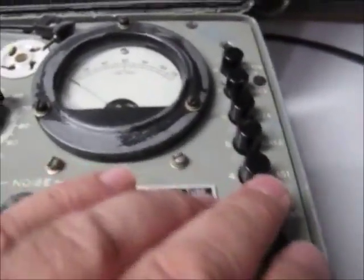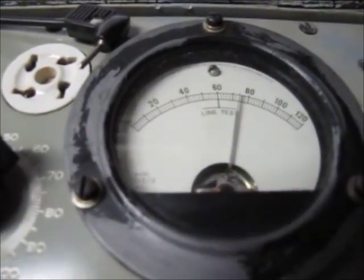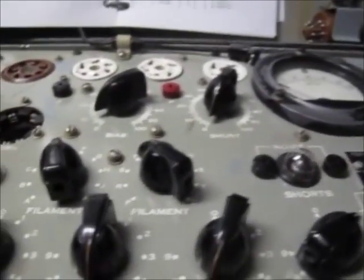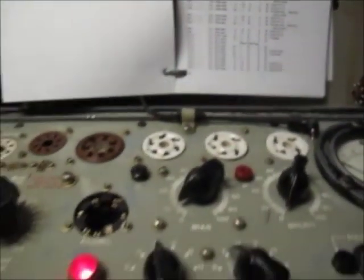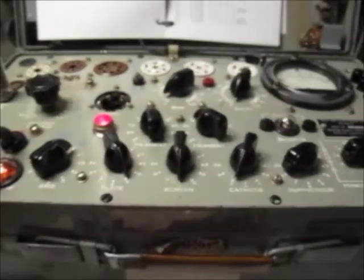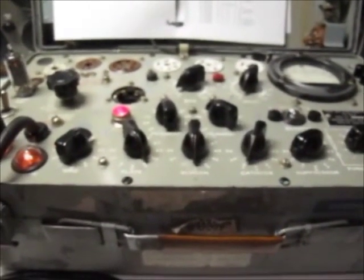By pushing the mutual conductance button, we can check to see where we are — and it's up at 75. Although that doesn't really tell us exactly the currents, it's a recognised test for the tube under average conditions. This differentiates itself from the AVO test where you're actually checking the physical GM. To be honest, this is basically what you need to do a lot of diagnostic work — you really just need to know if the tube's good, bad, or halfway in between.